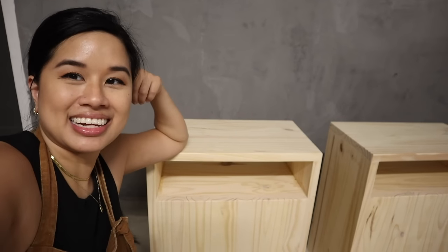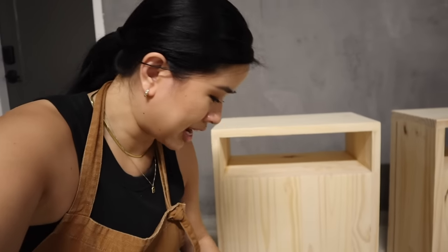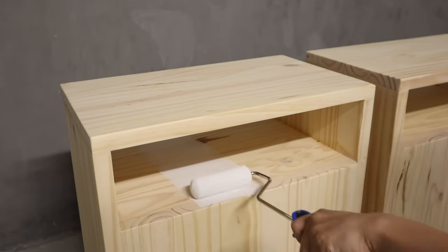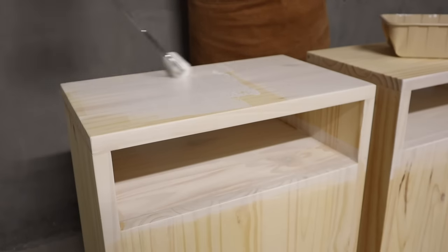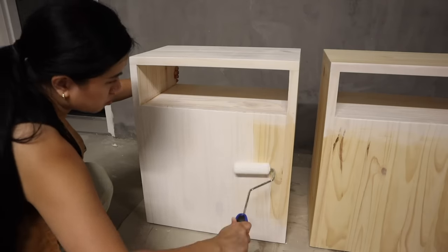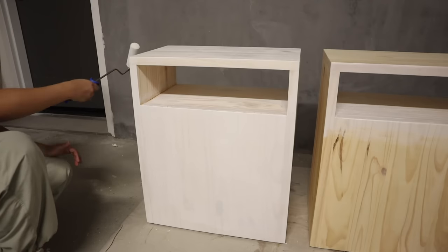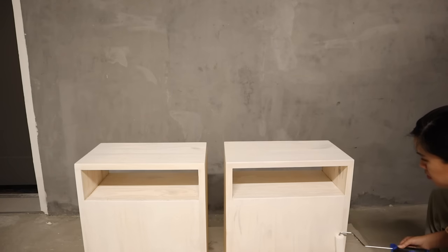It still blows my mind that I'm able to make this. It's all sanded down and now I'm going to add some furniture glides to the bottom and then prime all of these sides and also the inside. Priming and sanding is super important because you want to ensure your wood is really smooth. Since I'm using wood and painting over it, there's a possibility the wood grain will show through. If you want to avoid that altogether, try this project with MDF, which is super smooth — just make sure you prime that as well. I chose wood because I wanted something super high quality that will last through time.